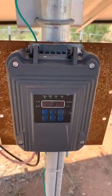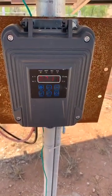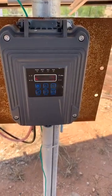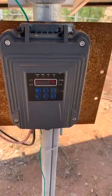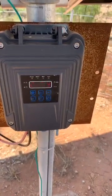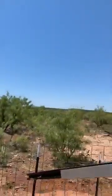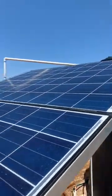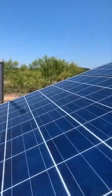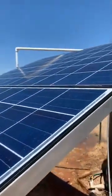On a really good sunny day at 135 feet I'll get 2,700 RPMs. As long as it's spinning around 1,500 RPMs I'll still get some water out — maybe half a gallon to one gallon per minute on a pretty cloudy day. Right now it's almost high noon, perfectly sunny. The panels are a little dirty — that's another thing: keep your panels clean, spray them off once in a while. There's a little dust on them now but it's still running real efficient.